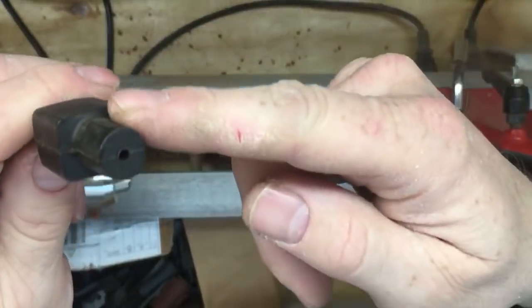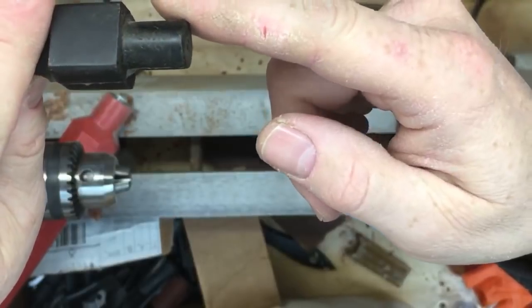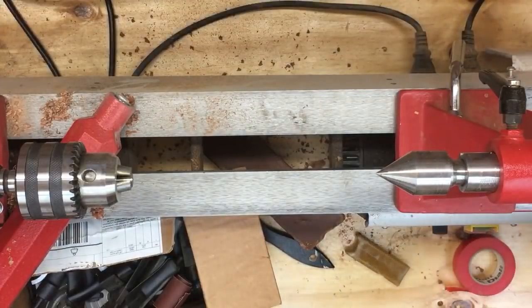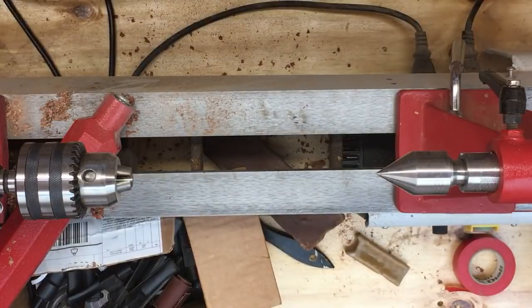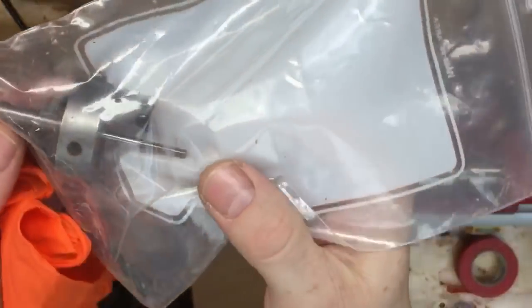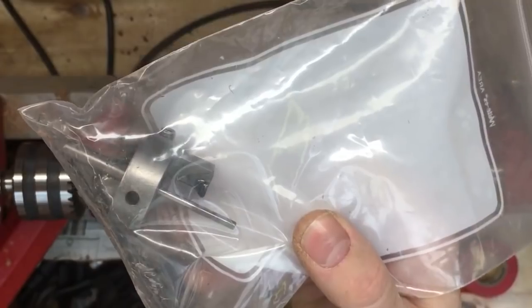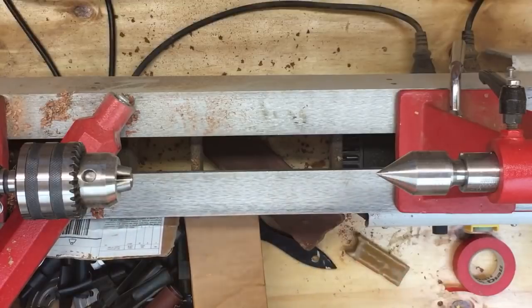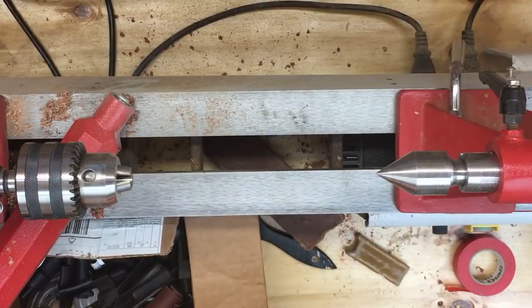You've obviously got to get the tenon to the right size to fit the pipe, so that's something you've got to plan out in advance. Make sure you're getting the right diameters on the mortise. And that's the bit which I don't enjoy. Although I do have a tenon cutter tool, which I bought from Vermont Freehand, it's a pain and it's very imprecise. You're slightly off and you're done. You overdo it and it's loose, you gotta start again.